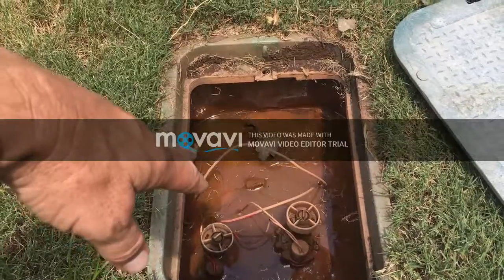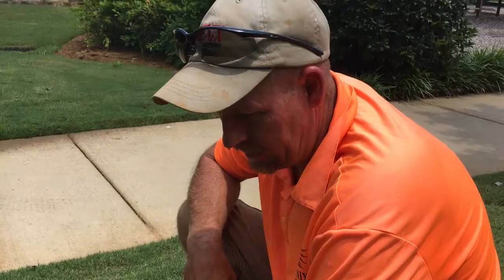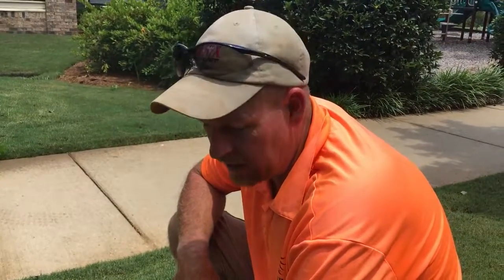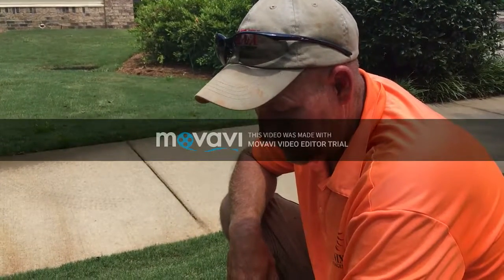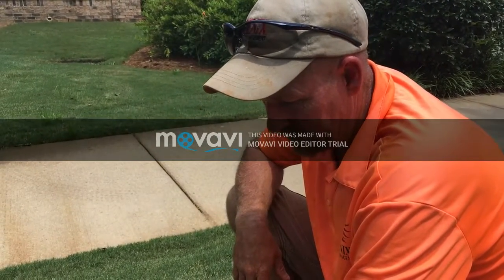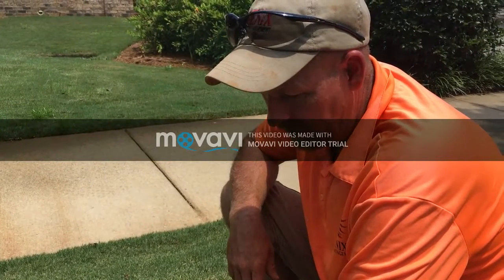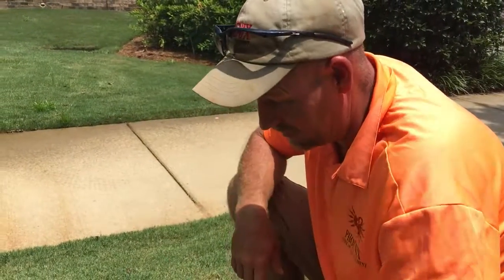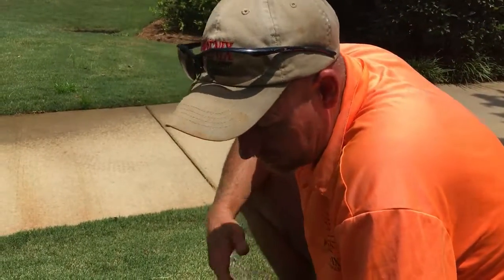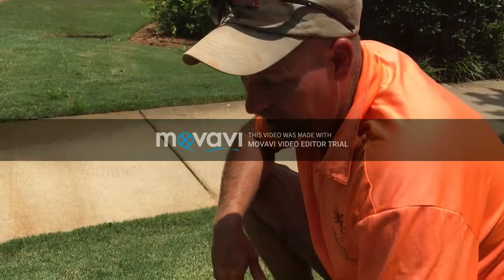And one of the biggest reasons why Chris didn't want to do that was because you were getting such a good reading on your solenoid, correct? Right, exactly. I knew there was no cut wire, due to just the simple, probably 2-3 minute check of testing everything with your amp and voltmeter there. Yeah. That eliminates a whole lot of wasted time trying to locate something that didn't need to be located. Unless you didn't know where the valve was. Then you have to locate it.